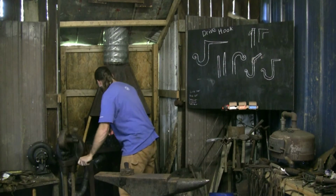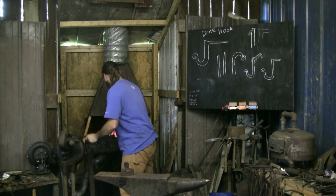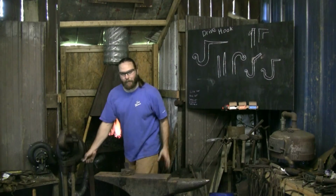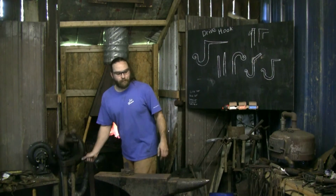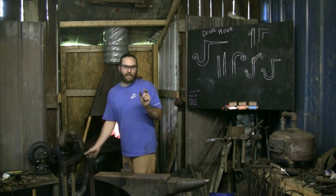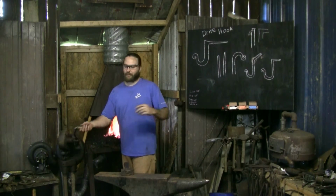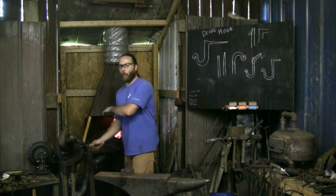We get it nice and hot. I'm just holding it by the hook right now. I prefer doing it this way, getting this side done, then turning it after. And like I say, you don't need a whole lot of stock, and I think in your video you had to cut some off, and that just comes with experience, knowing how much you can draw from what stock you started with. You can draw a whole lot out of 3/8.